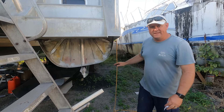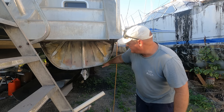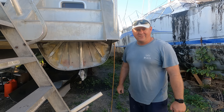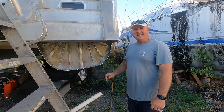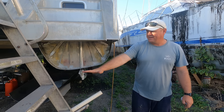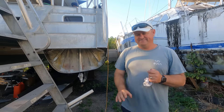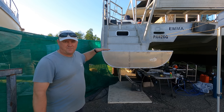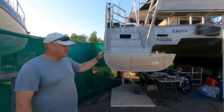So what we've done is we've extended her out a bit further. We've batted her back to where the rudders are. And another thing we're trying to do — if you look here, this is an asymmetrical shape. The idea behind this shape was that when you start flying a hull, this becomes the flat cross section when you are planing along. We don't come even close to flying a hull, so it didn't really work for us. So what we're doing is taking it out and making a flat cross section at the back here as well.